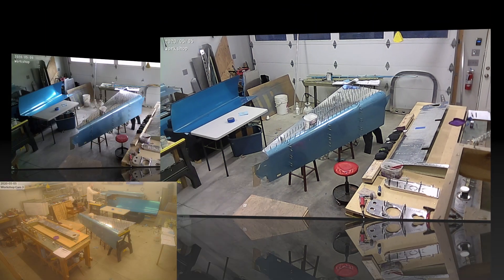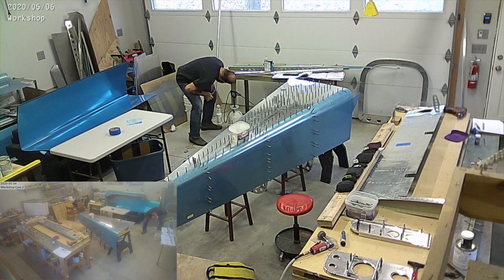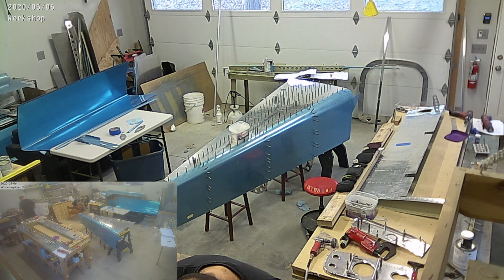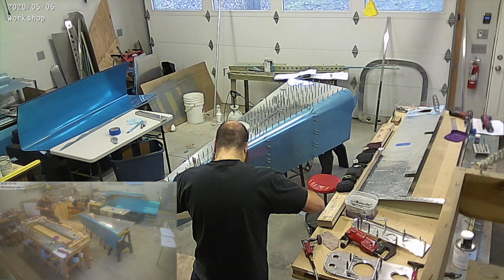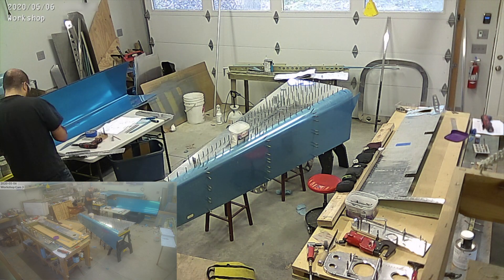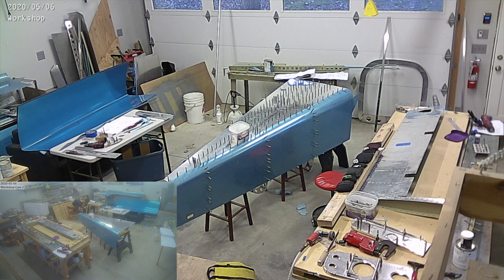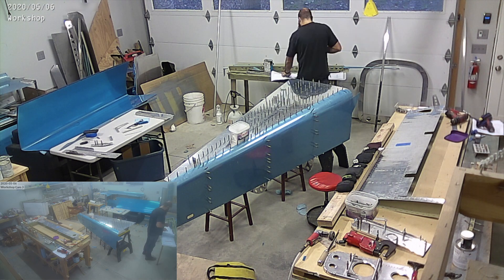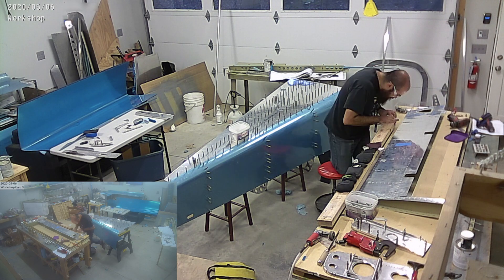The tail cone is coming together, finishing up those J-channels and going to slide them in, and then Mary and I are going to drill them. The J-channels don't have any holes in them, so you sort of align them and then drill the holes into them. The skin has the pilot holes in place, so you align it, carefully drill the holes, and Cleco them all in place, and then of course you tear everything apart. It's interesting to watch the tail cone rotate — it's just on two benches, two stools, not the most sturdy of ways to hold it up.